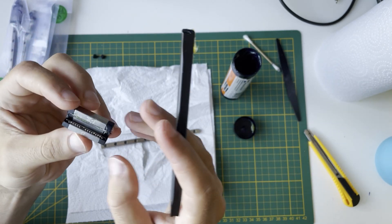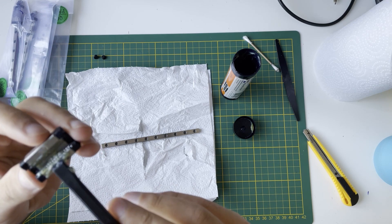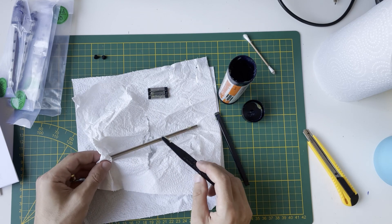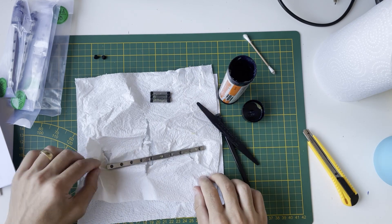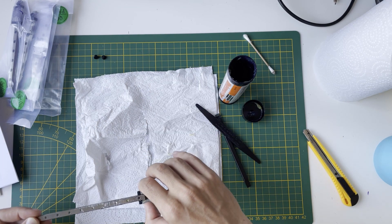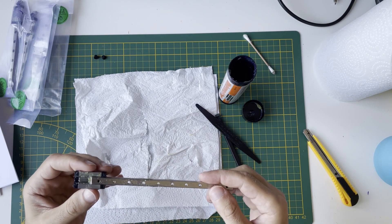We will clean the excess grease of course. I'm also applying grease to the side of the rail and the top of the rail. Now I need to put the carriage back. With the grease, it's now harder to miss placing the carriage.